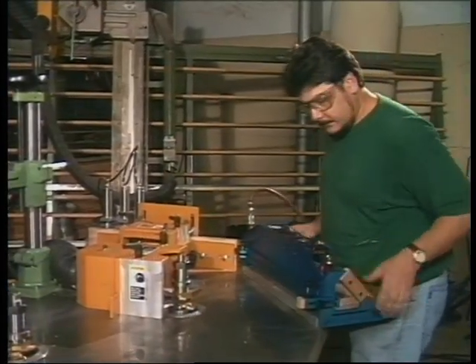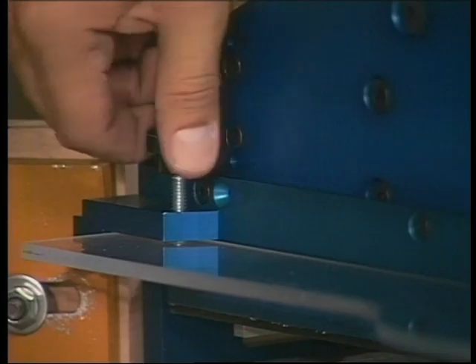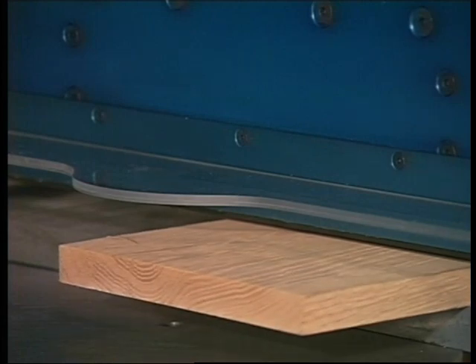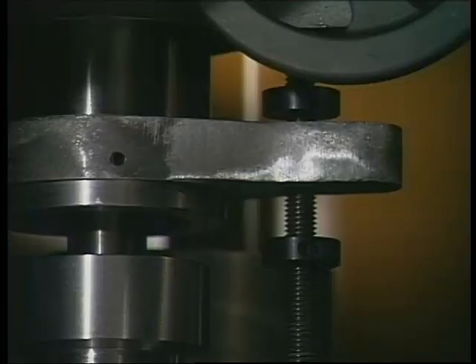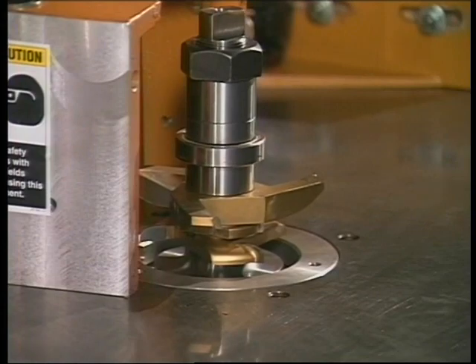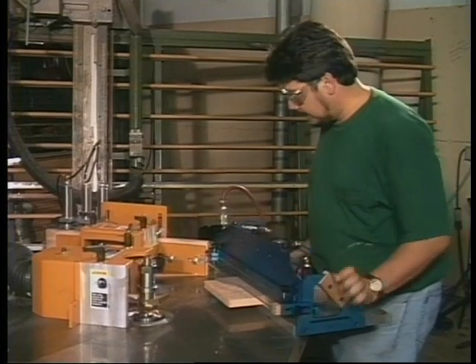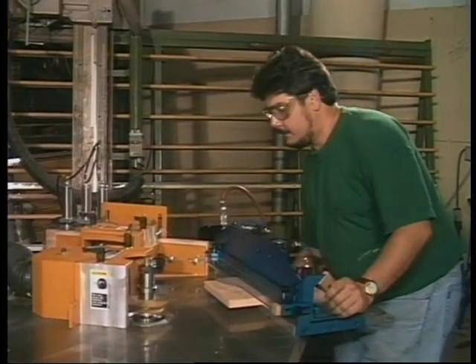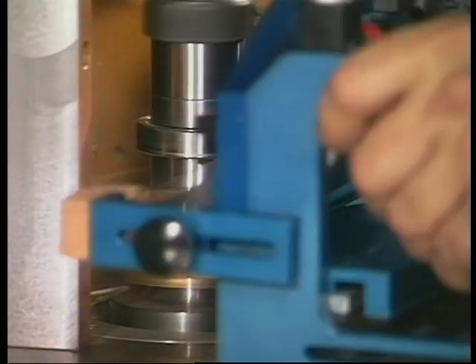For safety, the attachment allows the hands to be positioned well away from the machining area. Next, the raised panel is machined at station number two. The panel cathedral arch is machined first, with the aid of our arch attachment, a guide bearing, and template. Ten panel arch templates are standard, up to 24 inches in width. A self-centering feature accurately positions the panel in relationship to the template. The spindle height is adjusted to the upper stop setting to accurately set the cutter. Station number two is powered by a seven and one-half horsepower spindle drive motor, with the one and one-quarter inch diameter spindle set at 6,100 RPM, to eliminate burnishing on the end grain due to excessive rim speed associated with large diameter cutters.